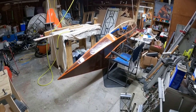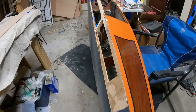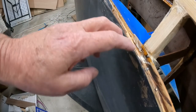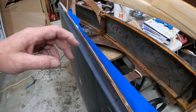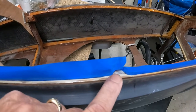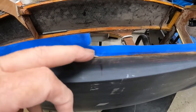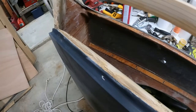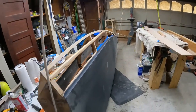I got the toothpick laid on its side, ready to put the first non-trip on. I've got it prepped. I've got the little channel all cleaned out and ready. I've got some blue tape on it so it won't run over on the inside — I can see it on the outside if it's going to run over, but on the inside I couldn't, so I taped that off. Got it ready for install. You can see the end of the rib right there — I've got all that rounded and filleted so anything that runs over there will also bond to that. It'll come right on through here and make up in the slot. I've test fitted a bunch of times. Fixing to put the first piece of plywood on it.